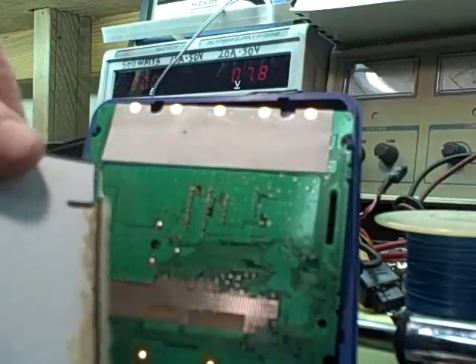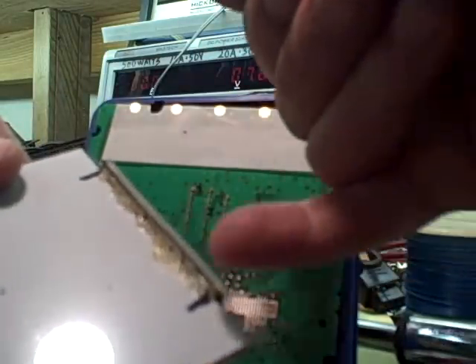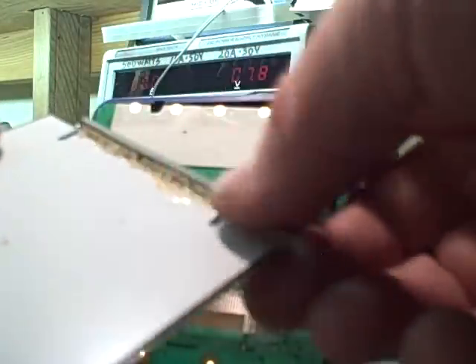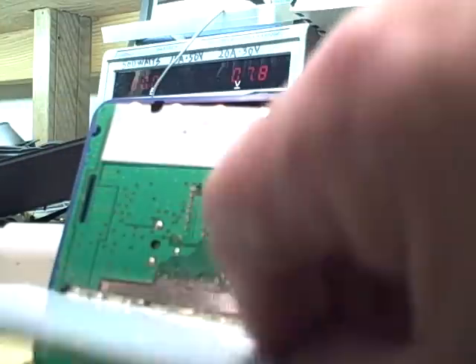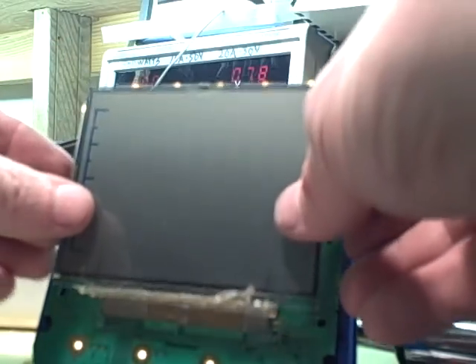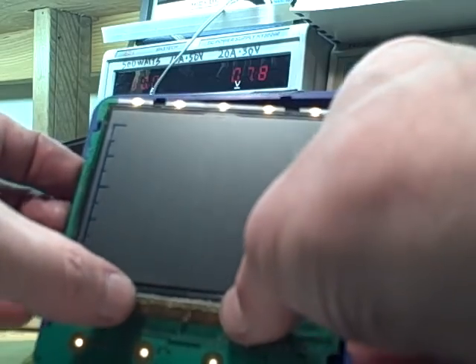You clean off your LCD, the backing. Clean it off real nice and you'll see just shadows over the connectors. Place this like that. I put a little hot glue just to help hold it — it doesn't really stick to it, but it kind of keeps it in position while you do this. You're going to take your LCD and press it against and that'll make the connections.